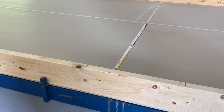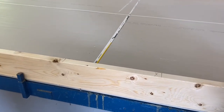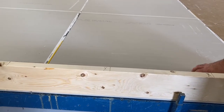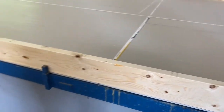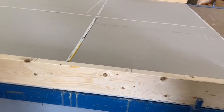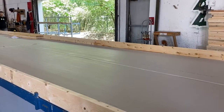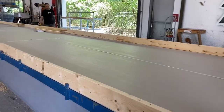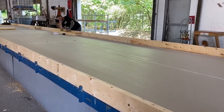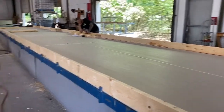So you don't nail these at all, huh? Or screw them? No, we don't even screw them. We nail the framing together. Right. But we use the foam seal to adhere the framing to the drywall. Wow. That's the only thing. And when he picks this up, the only thing holding that drywall and framing together is the foam seal. Once the whole wall is framed out, it'll go along and spray. It comes out a consistency of like syrup, and then expands.